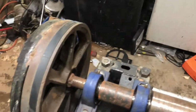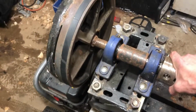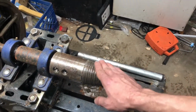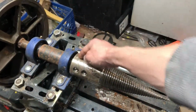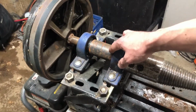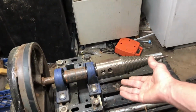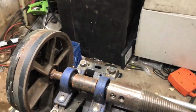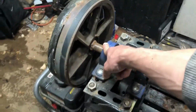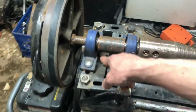Secondly, I went with an 1 1/8" shaft because it's what I had. In retrospect, I would have gone for an 1 1/4" because most of these that you find just come standard 1 1/4. Where I ordered it, they were able to customize it to an 1 1/8", and it worked perfect. They did perfect with their sizing. But if it was 1 1/4", I would have had more options of where I could have bought it right off the shelf rather than them having to make it for me. So first of all, go with an 1 1/4" shaft. These pillow blocks, I spent I think about $10 a piece on them, and there's 4 of them, and I'll explain why in just a moment.